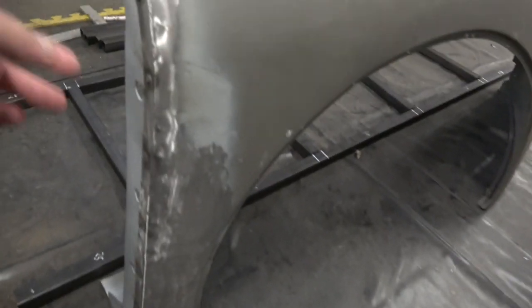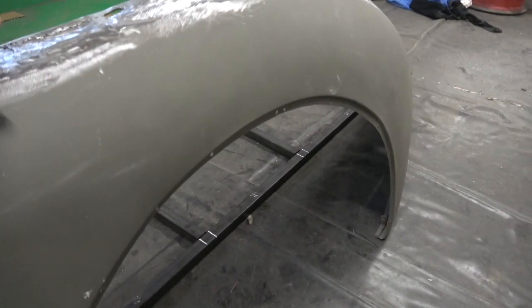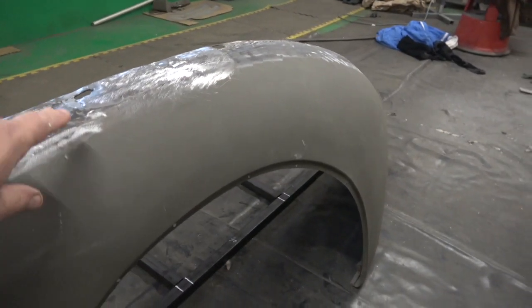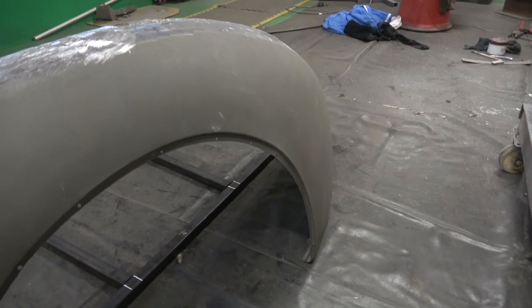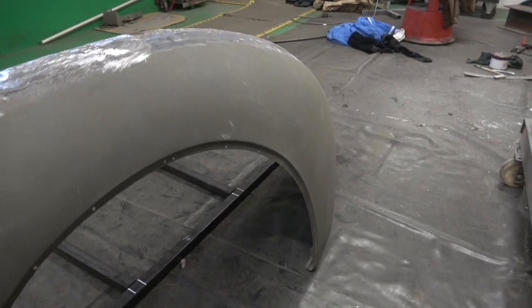These wings, we've done all this new edging and so on, but one of the problems with them is they're quite flimsy, as you can see, and there tends to be an awful lot of movement in them. Now you can see we put some lead load in there, but trying to hold it, it's extremely flimsy. So what I'm going to do is make a metal buck.